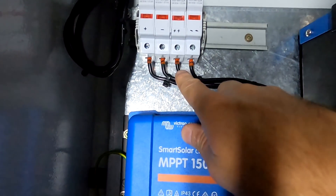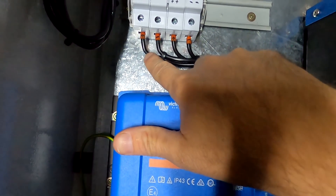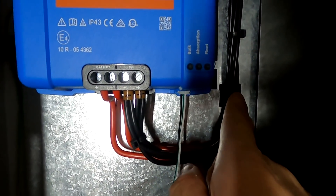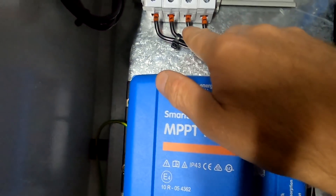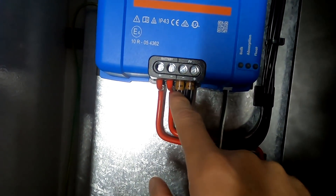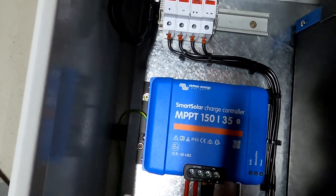I'll also reuse the cables down here and parallel them up. This is four square millimeter cable. If I can, I'll leave this all in here and just rearrange slightly — then I have two four-millimeter cables in parallel supplying solar power into the solar charge controller. I don't want to cut cables and put new boot laces on everything, so I'll just double up the cabling. I'll measure the DC anyway before starting.